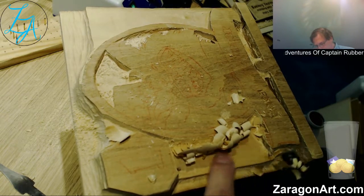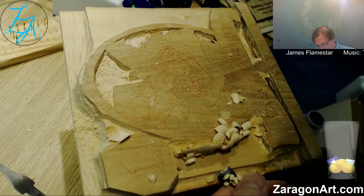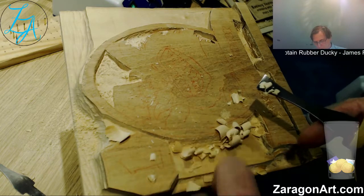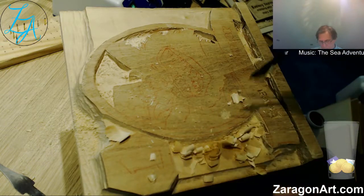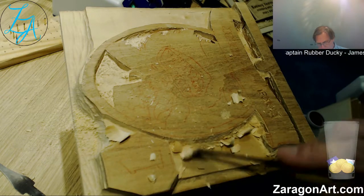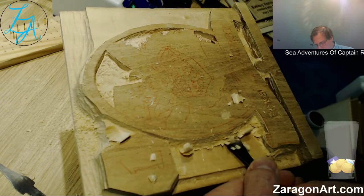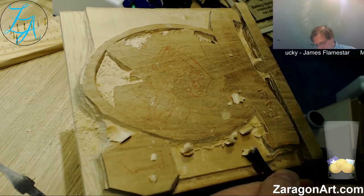And if you're forced to carve along the grain, then what you've got to do is control that in some way. Things like stop cuts help, and that's an exaggerated form of what I was doing at the start with the power tools, but just driving a chisel vertically down also produces a stop cut. Because a stop cut, a rip if you like, always stops when it meets another rip. There's a gap, so it can't physically carry on.